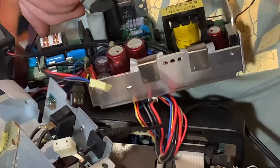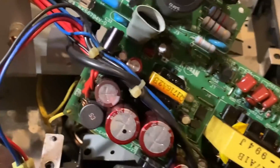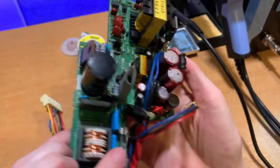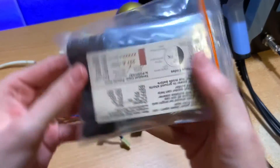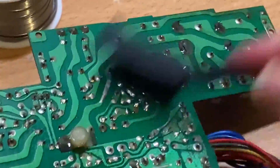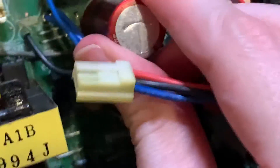Which brings us on to the power supply — looking pretty good as long as you don't look too closely. Most of the caps look nice from the top, but take it off and it is absolutely wrecked. You really do want to at least recap one of these power supplies because the capacitors from this era used a type of electrolytic that eventually became very extremely corrosive. I've got a cap kit which also has a few other power supply components. I cleaned the bottom of the board, added some flux, and out with the solder gun.